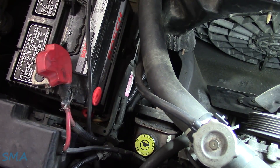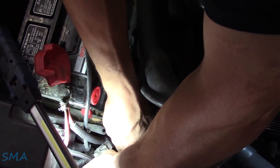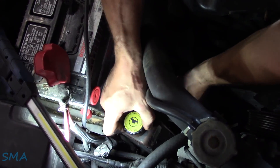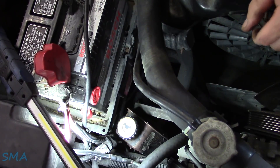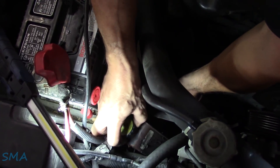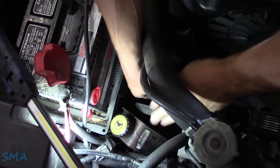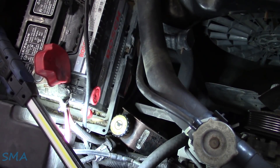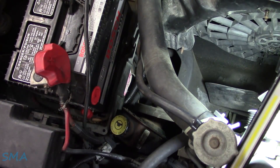There we go. I hope this comes out, which it should. We're going to have to loosen up the bracket here. So like I say, I don't want to pull this water pipe out. We're going to have to wrench one bolt. The problem is they've got it all siliconed up, so you know darn tootin' well they were having a problem with that pipe sealant, and I don't want to be the last guy to touch it.